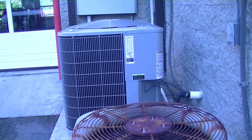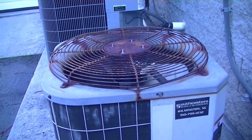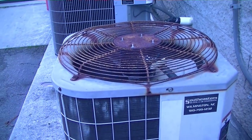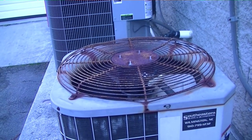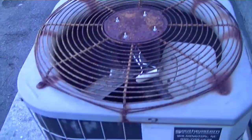There's a new Carrier system right there that evidently replaced the one that was sitting here last time I was here. Someone has replaced that one because it was doing the exact same thing this one was doing. Discharge was going out the side, no top discharge whatsoever. The coil is relatively clean, so it should have some top discharge. There's a new fan motor I had to put in it, but I ordered a new blade and we're going to see if that blade helps.